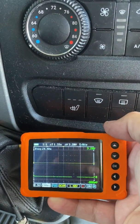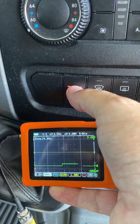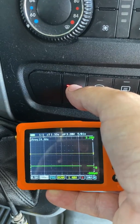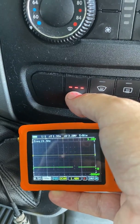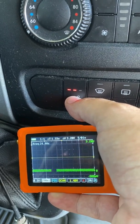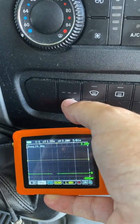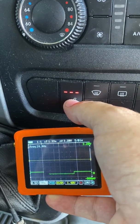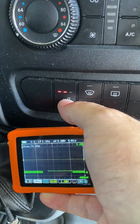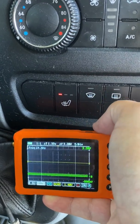Plug is switched — the other heating element is plugged in. And now we've got current. Not as high as the passenger side because the circuit's only doing half the work, but let's hit it again — duty cycled. Different duty cycle. One of my elements, which I'm sure is really expensive, needs to be replaced. And since nobody pays me to fix my own cars, it might be a while before that happens.